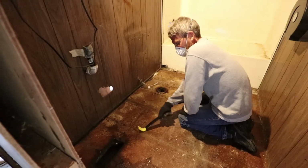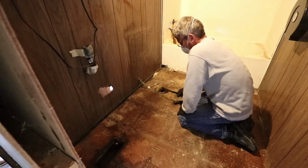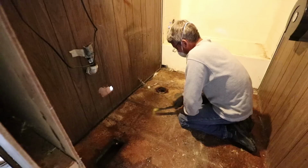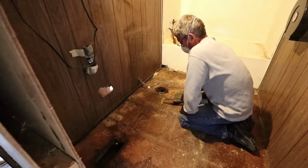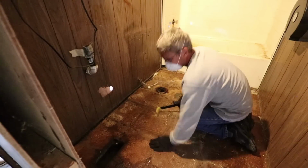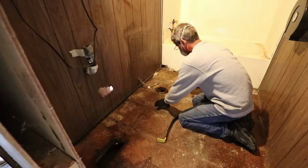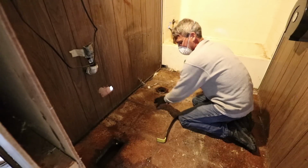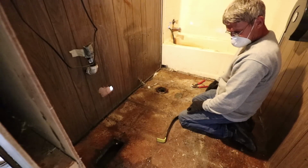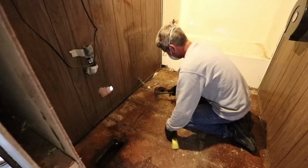Since this has got wet, you can see that this is humped, which happens a lot with this old chipboard type stuff. So I want to take a little chunk of this out just to make sure that the actual subfloor is still good. That's the only thing I really worry about. Normally, that stays good. It's just this that is a problem. I really dislike taking this out. It's so hard. It comes out in little tiny chunks. But one room isn't bad. Doing the whole thing, it's like, no, thank you.